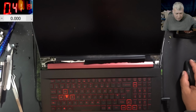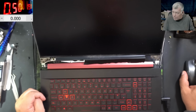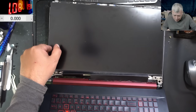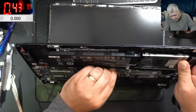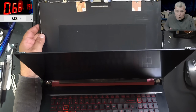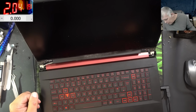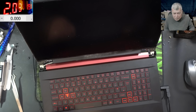But just to make you happy, I'm gonna come with a power supply with 3.3 exactly there. How? I'm assuming I have to plug the battery. Yeah, let's plug the battery. The laptop is still on, that's good. The battery is plugged in. We are expecting to see an increase on the charging current. The current is not going up? Yeah, it is going up. We do have the charging light, 2 amps. I'm not happy with that. I mean, I want more current.